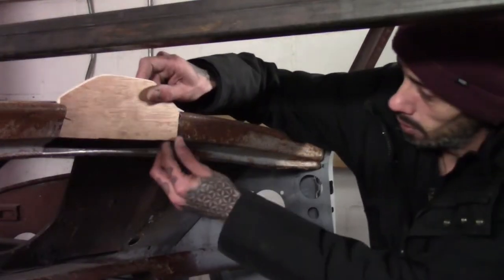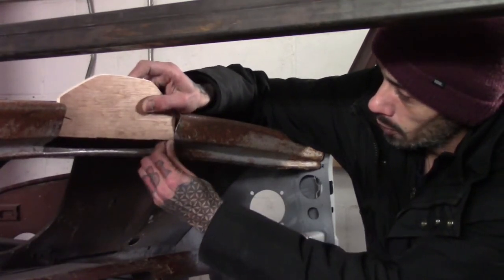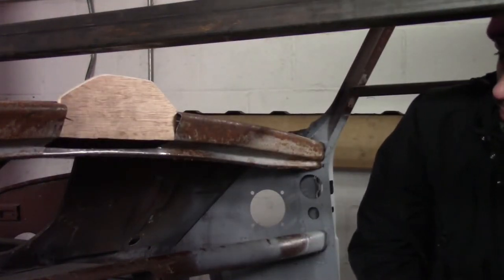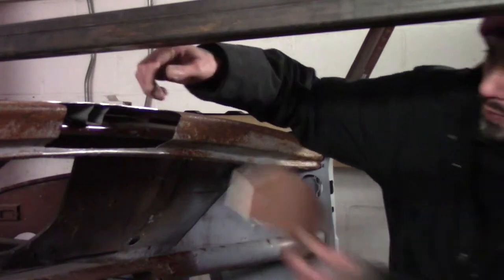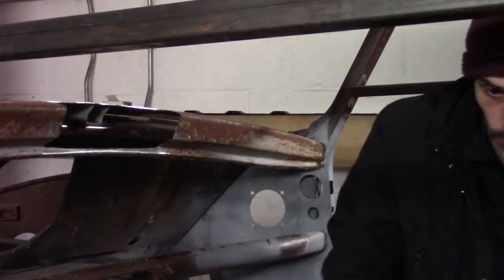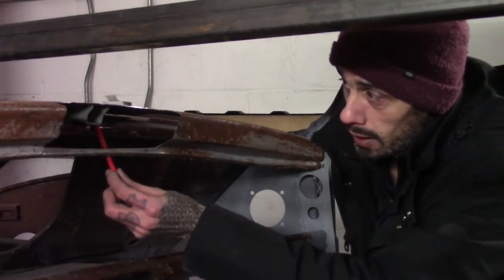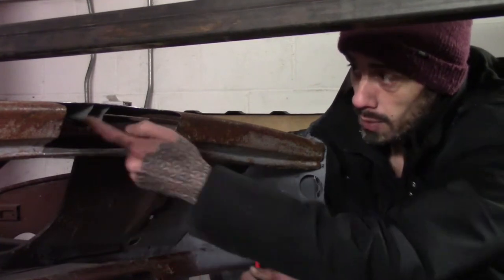And this is the rough wooden template for our 2 clock pod, which is going to sit kind of like that. Bearing in mind we've got the depth of the clocks to fit behind the back of this piece of wood, we are going to have to trim this mounting bracket ever so slightly. So we're going to just saw it at an angle along this side, just to take this main edge piece away here.